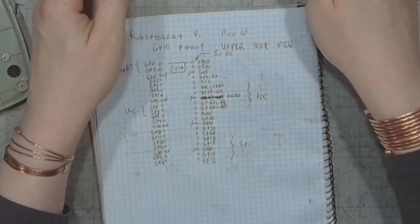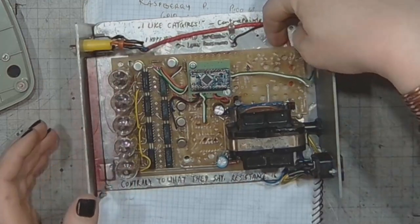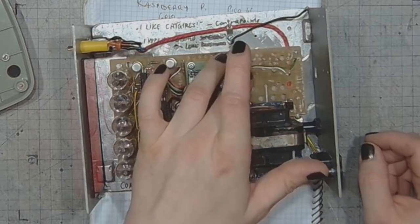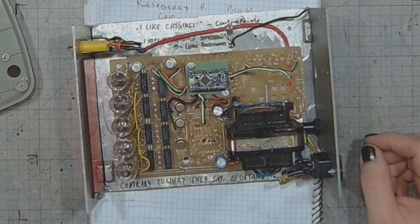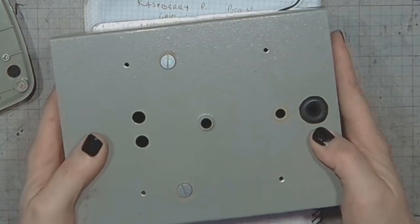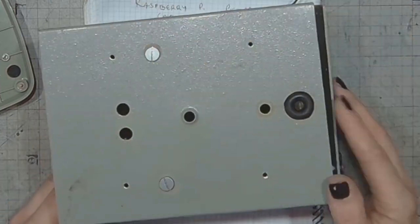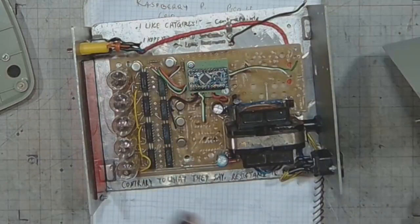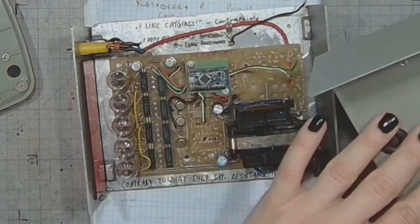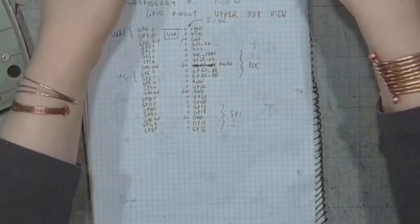It's about RF shielding. See, the way it was done, the NodeMCU was placed here. It has the Wi-Fi interface, and then it was covered with metal. See where I'm coming from? Shielding. It would be just shielding the RF signal. Not a good way to design electronics, right?